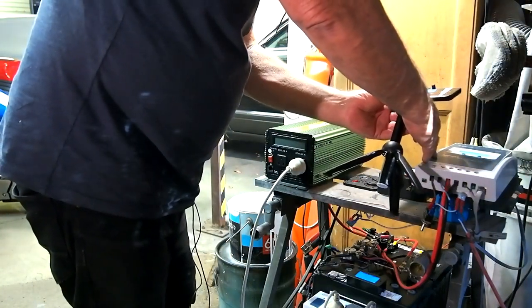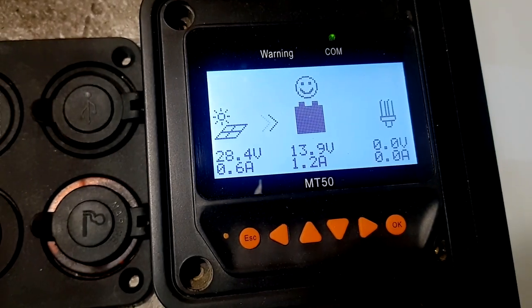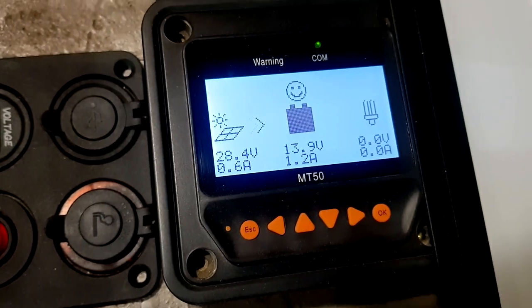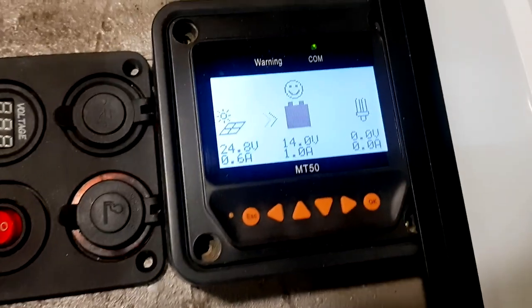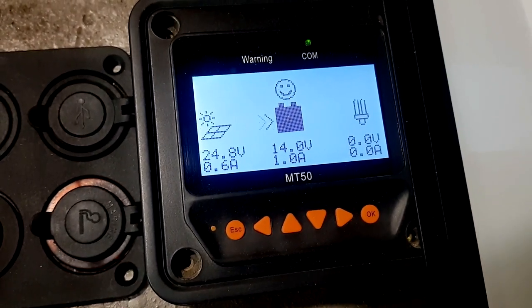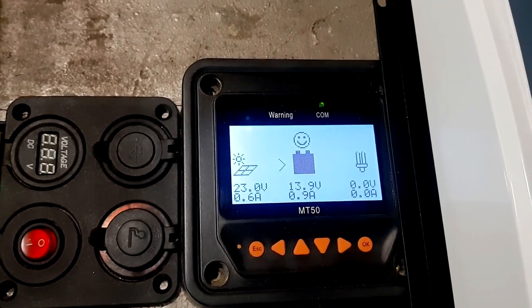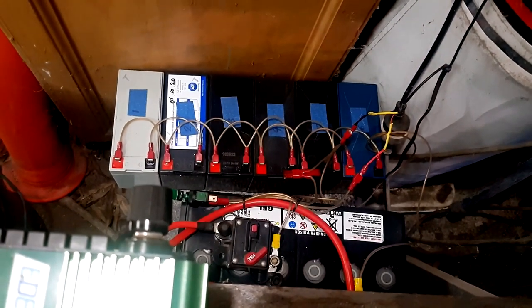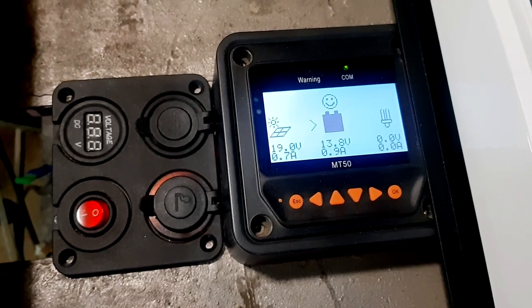Power from the sun has been cut, power from the batteries is cut. To turn on the secondary bank of batteries, we turn on the switch and that powers up the system, then we turn on the solar. There's the system running — the secondary bank of batteries. There's only about 15 to 28 volts on the panels being produced at the moment because the panels are pretty much in full shade. It's coming around to 7pm in summer. The charge controller is converting that into 14 volts at 1 amp. The batteries are on a bulk charge — not a float charge — because this freshly connected bank needs to stabilize and equalize over the course of the next full sun day.